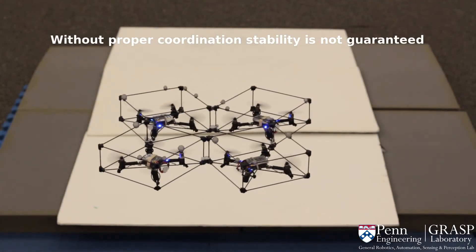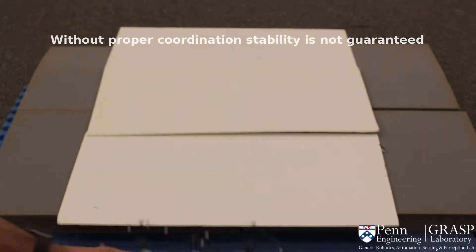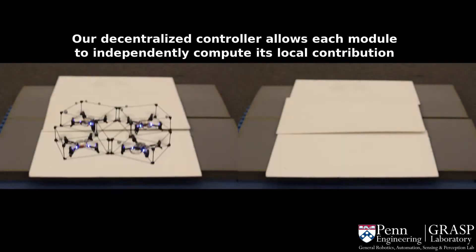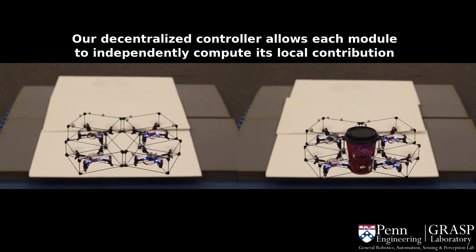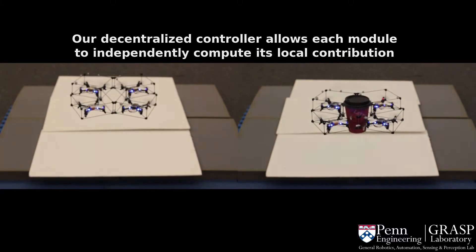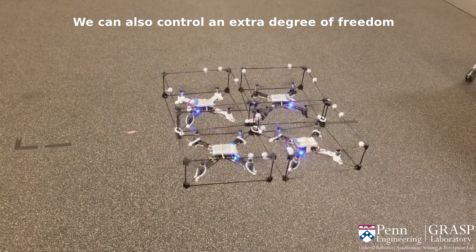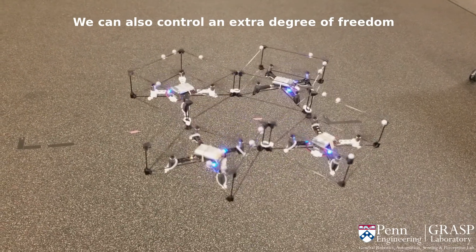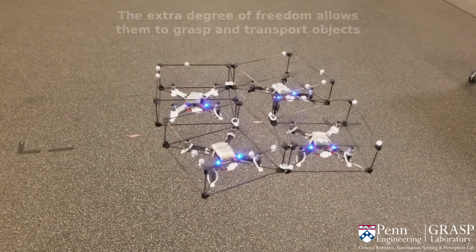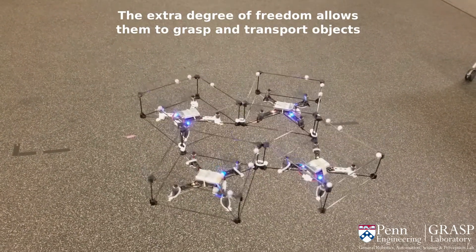With inappropriate controllers, the flying gripper becomes very unstable due to inappropriate local attitudes. Our decentralized controller allows each module to configure its own behavior based on its position and orientation relative to the flying gripper frame. This approach distributes the flying gripper's desired state — including position and RP angle — to the four modules. Using the local IMUs and the RP feedback from the external observer, the robot can compute its own control input.